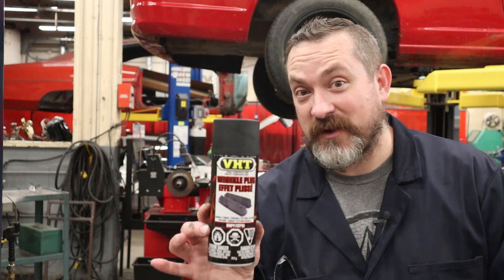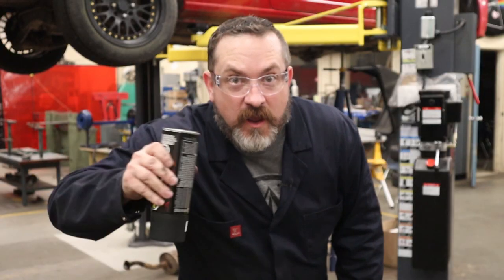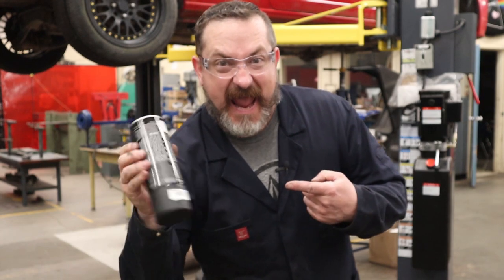Here is your 30-second spray painting demo. The first thing you gotta do is really, really shake these up. And I shake them upside down so that the solids will come down as you shake it. And a tip, if you are shaking it hard enough, you should see the little dents in the bottom of the can. When you go to actually spray, there is an arrow on the tip, so make sure that you spray it away from your face. You'd be surprised how often people do that.